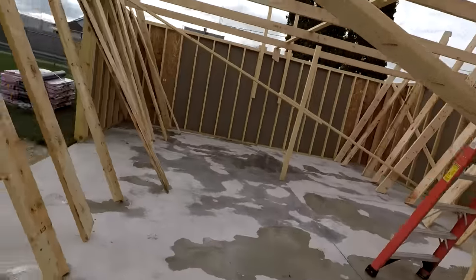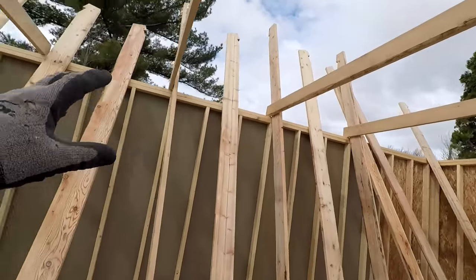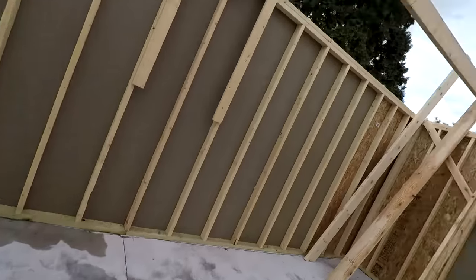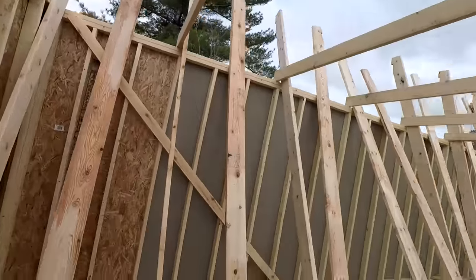All my rafters stood. I like to go through and figure everywhere where a sheet of OSB is gonna break and make sure I've got a decent straight rafter with no bark on it there. Makes life easier. Also, gable rafters I try to keep nice and straight too, so I have a nice straight gable. I don't have to mess with moving a bunch of stuff.